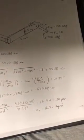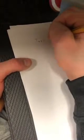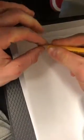Now that we have the bending stress at A, we need to calculate the torsional shear stress. So this is going to be tau xz, and it's going to be negative 16T over pi d cubed. Since the torque is negative as well, that's going to be 16 times 875 over pi times the diameter cubed, which is 1. This is calculated to be 4.456 kpsi.